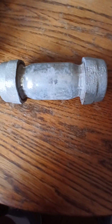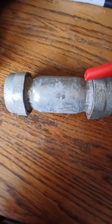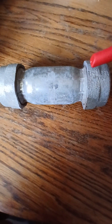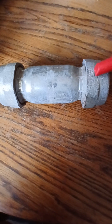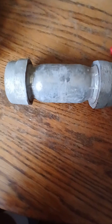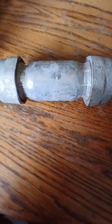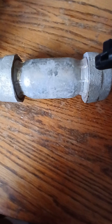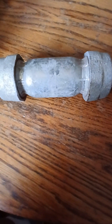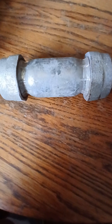I'm not certain if it's a compression fitting. This end will screw off, this end will screw off, but when you do the galvanized pipe, be aware that you need to have the edges smoothed, like with a side grinder, and make sure the edges are smooth, because if you break this rubber piece inside here — this rubber piece helps make the seal — if it has any burrs on it and it's not deburred, it will cut the rubber, and the rubber will not hold a tight fit or seal.